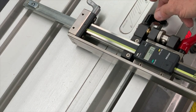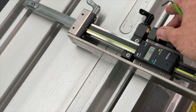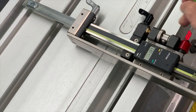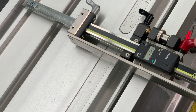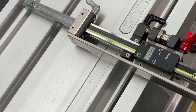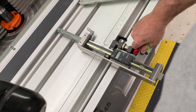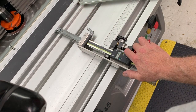I'm going to lock the gray kip lever and the black kip lever. Now I can use the micro adjust — first I have to unlock the bar, and then I can use the micro adjust to actually move the bar forward 1.37 millimeters. Now I can use the red kip lever to lock that down. This bar has now been moved 1.37 millimeters towards the spindle. We can bring the thickness stop back against the bar and make sure the red kip lever is solidly secured. Now we should be in good position to run the cut.